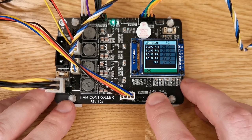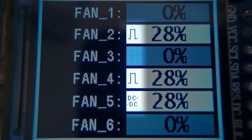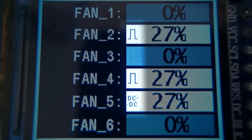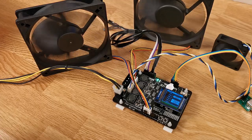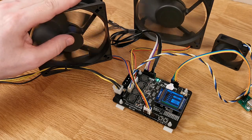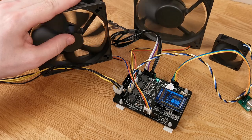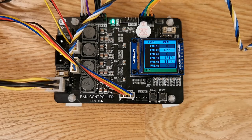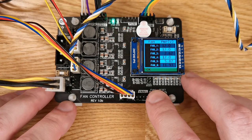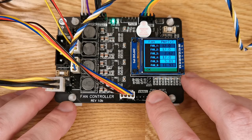Inactive sensors, if any, are shown on the next screen — including digipot and MCU sensors whose readings are ignored but can be activated. Then there are three fan screens. The first shows the calculated PWM percentage or voltage, with a small symbol on the left indicating control type: PWM, DC-DC, or on/off — that mode exists too. The next screen shows current RPM. I implemented a controller that checks for deviation from expected RPM: if the fan is slowed, it first beeps as a warning, and if slowed further, briefly spins it up to maximum. The third screen shows voltage on each fan channel — for the first two without DC-DC, it displays the power bus voltage.